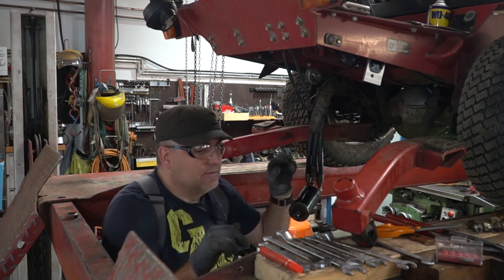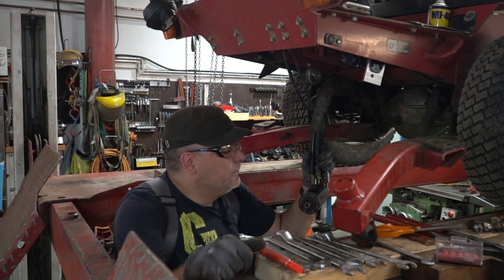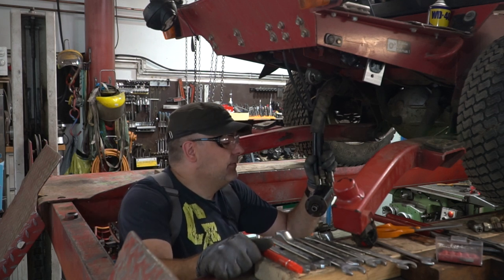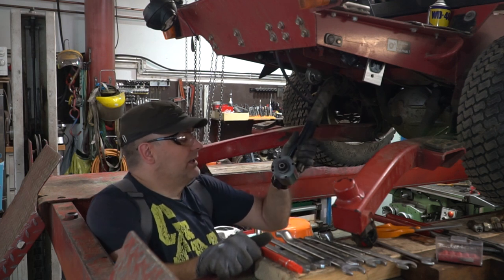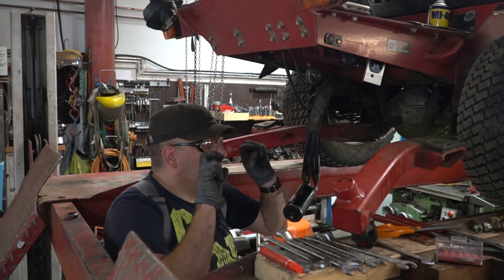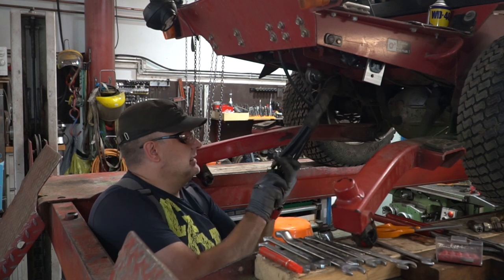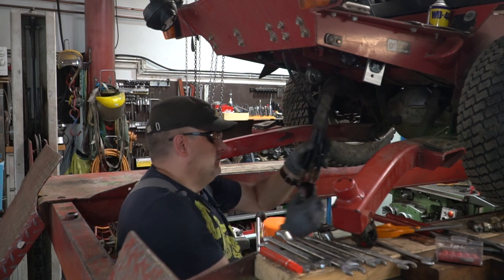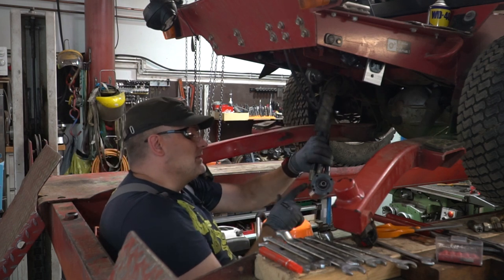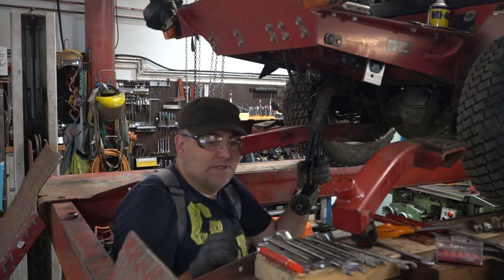Now the status of this repair is that this happened almost 2 weeks ago, 10 days ago, and we managed to find almost same type code of Orbitrol from eBay, from UK, and that was delivered a couple of days ago. And now the idea of today's subject is to switch this one to the new one, it's a used part. But we have some twists in the plot, at least the fittings here. What are these fittings? I cannot see anything. The pressure and tank line, they are one size bigger O-ring face seals in this unit, and in the spare part they are smaller ones, so I have to do something for that.